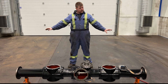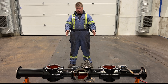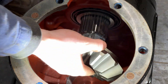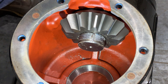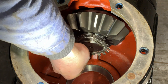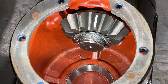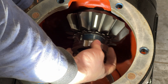We're at the point now where everything's all clean, taken apart, and we're ready to go back together. We're going to start off with putting the output shafts back in, get those timed up properly, then we'll move on to the input shaft. It's time to put the cross shaft gear back in, so we'll drop that in there and make sure it's fully seated. We'll grab our locking washer with tabs on it — remember, tabs away from the gear.